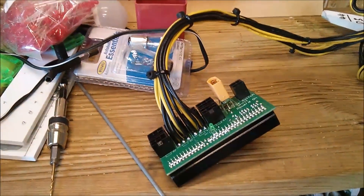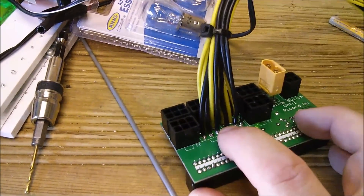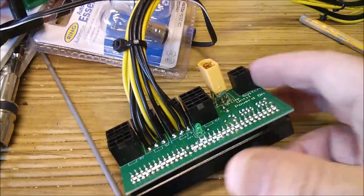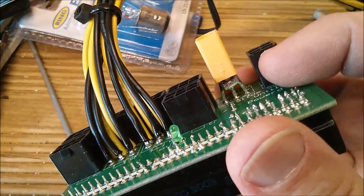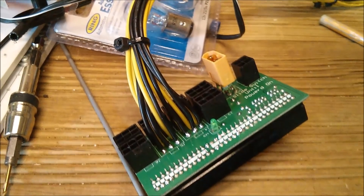Let's hook up this miner — I've been doing some soldering. This is one of these miner PCBs which I pulled a couple of these six-way connectors off and soldered the wires into the board directly. Those are the connectors that go onto the hashing boards and the controller board of the cryptocurrency miner. I also soldered on this XT60 in place of one of these six-pin connectors — there's a four-pin connector there I'm not sure what that's for. I used all three pins on the positive and all three pins on the negative, so that should carry the current the miner is going to take, probably getting on for 20 amps.